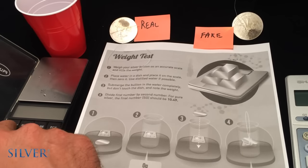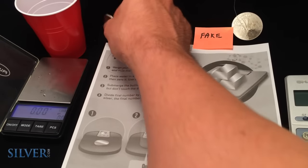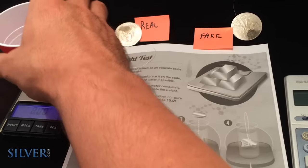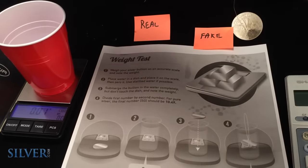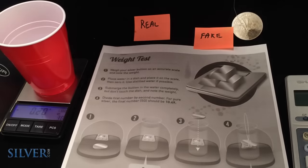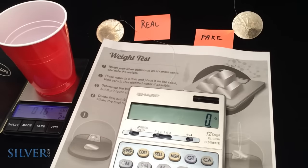Perhaps the best, most cost-effective testing for bullion products is the specific gravity test. For this test, you will need a digital scale, some distilled water, some string, and a cup. First, weigh the item in question. Then add the cup with water and balance the scale back to zero. Next, fully immerse the item in the water without touching the sides or bottom of the cup, and take down the measurement. Finally, divide the dry weight of the item by its water weight and you will get the item's specific gravity.